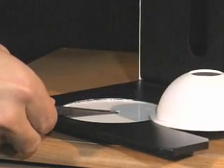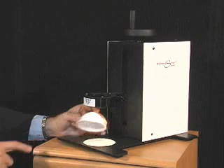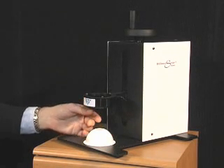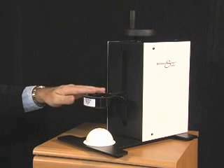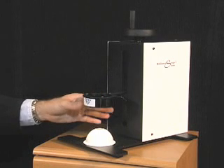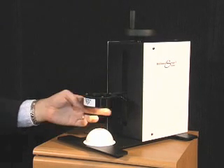The diamond is placed in a spherical chamber to provide the uniform light required for repeatable measurements. This chamber has a single opening in which the diamond is both observed and illuminated. As in my example, the diamond is then illuminated from above. The lighting used is a 360-degree light so that you get the same measurement even if the diamond is rotated.